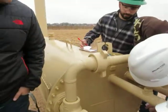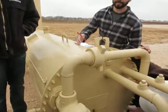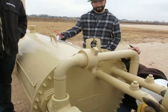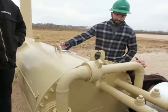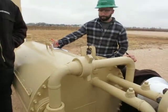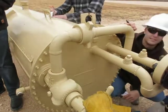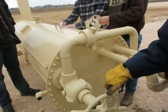So here's the size. It says it's a 2XXH. What does that mean? 2XX heavy. Double X, double extra heavy pipe. It's got a square footage area of 9.9 square feet, and it's got a maximum pressure of 6,500. So that first pass coil is rated at 6,500 PSI.